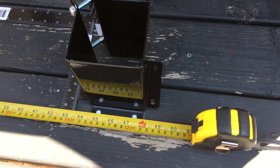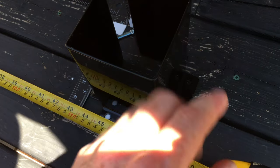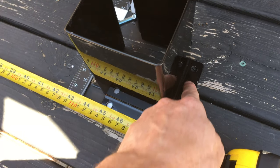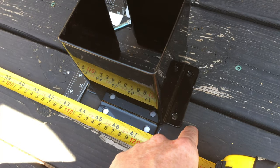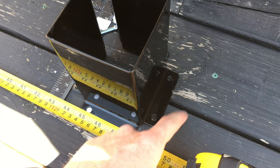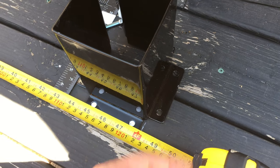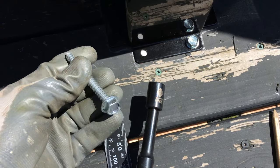Now we need to measure where our posts are going to go. For me, this is exactly where it's going to go. The main reason I'm placing it here is so when I put the screws through, it's not on the edge — I don't want the wood to break. Putting it in the middle gives the screw enough wood so it won't crack. Quick tip: if you're worried about cracking, drill the pilot hole first, then put your screw through.